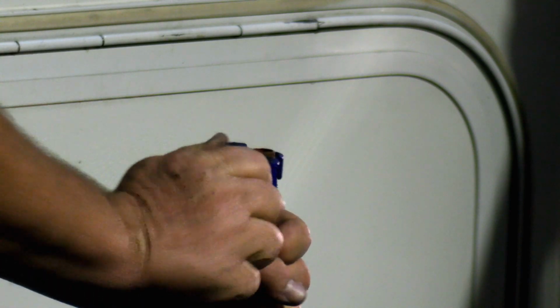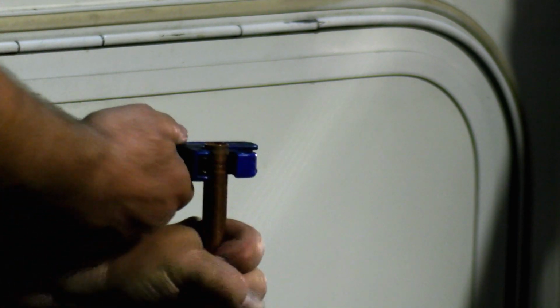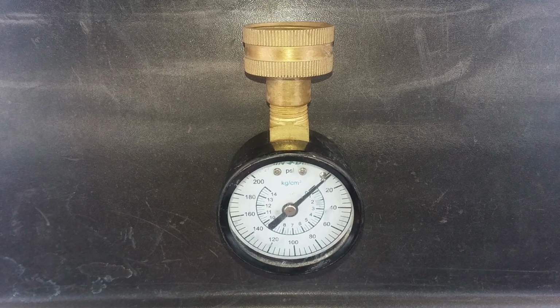The wheel design will slightly crush thin tubing at the cut end and will leave a burr on the edges. This burr can be removed with a reaming tool or a deburr tool after the cut is made. This tool can sometimes be used to cut plastic pipe, but this is not always recommended because of the crushing issues. Another type of plumbing tool that I consider to be a basic tool is a pressure gauge.